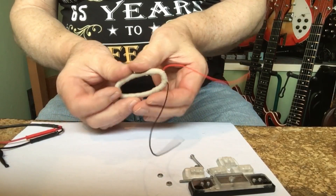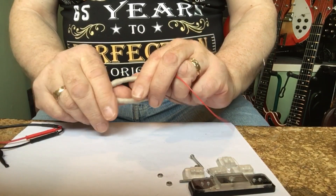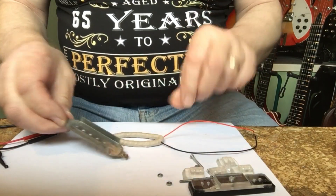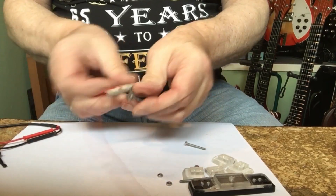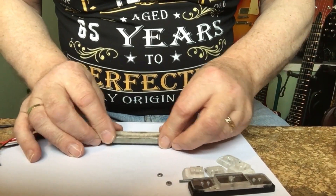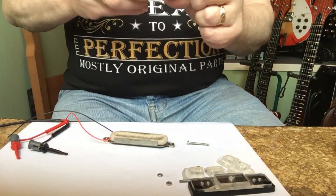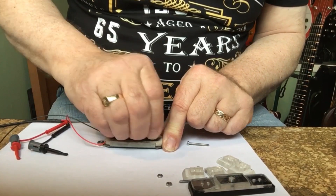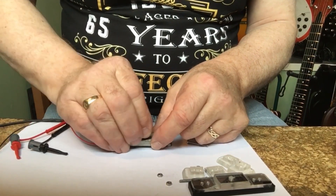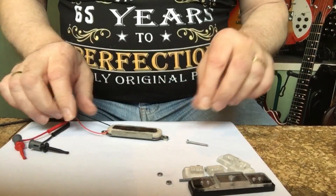And there you have one Burns-esque wrapped coil. What I would normally do now is press it into shape in an old vintage Burns base and drop it in there, do a bit of basic shaping. I'm actually using one of the magnets to make sure there's a good clearance gap in there. Pop that in there — nice snug fit.